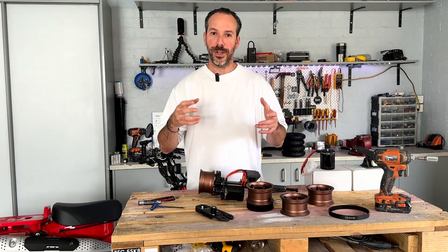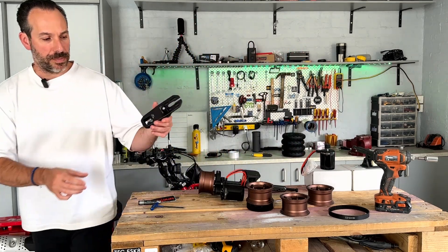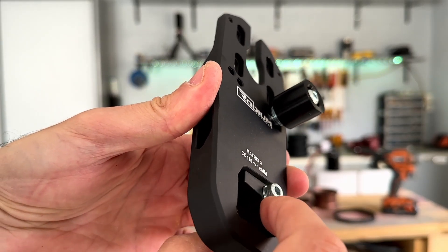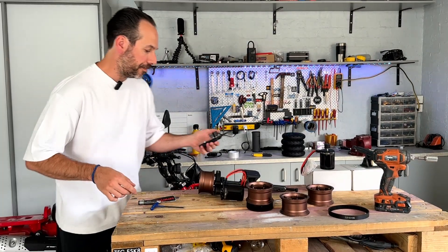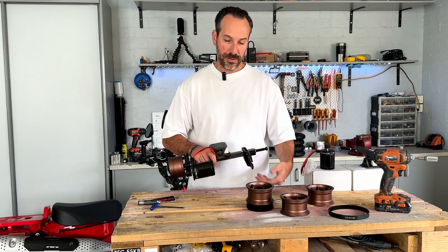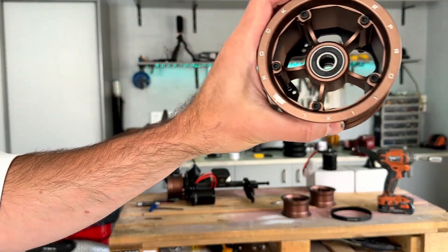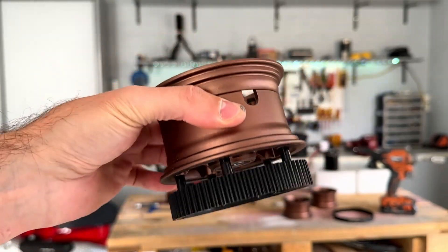These are the Radium motor mounts we're using with the pulleys. You'll notice the wedge is in there loose — that's going to allow me to slide this motor mount over the shaft of the Matrix 3 truck. The next step is to get the hub. I had to leave the hubs in the sun to heat up, put the bearings in the freezer, and then use a rubber mallet to put them in.